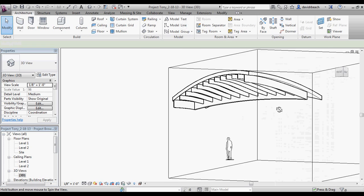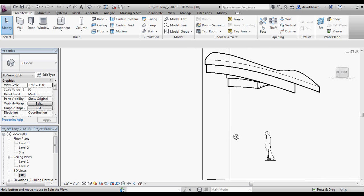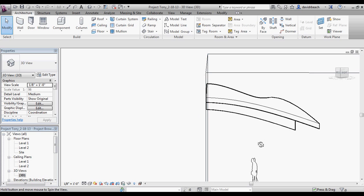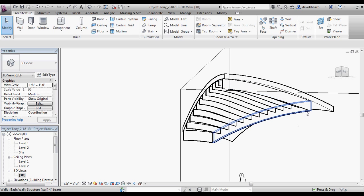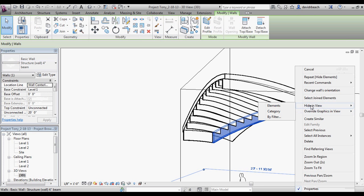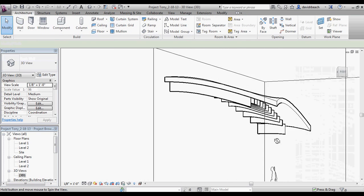Again, I feel really confident all these beams are going to work great, except, and I'm thinking about printing this side and growing it from this edge out. So I'm essentially going to stand this edge up. But if I send a line of plastic suspended in air for this beam right here, I know that piece is going to fail. So I know I'm going to have to send that as a separate element as well. So I'm going to hide in view element right there. And that is ready to print.